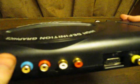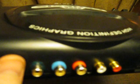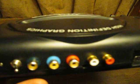And next to that, you can see all these. You have a red, a blue, and a green jack. And that is actually component video. Oh yeah, component video on a Sega Genesis. Now, that's not actually possible on a stock system. The system has been modified with a new video encoder to allow that.